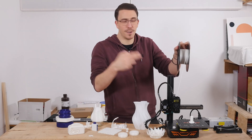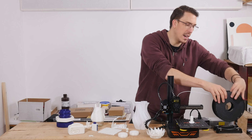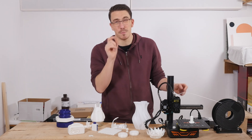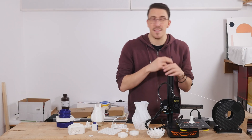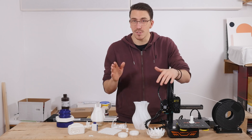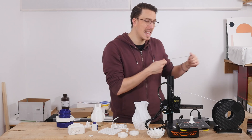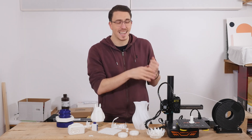The last caveat is where the filament comes in — it runs filament over plastic and that's going to wear away; it already started wearing for me. I moved the filament up above on a shelf and that's been perfectly fine. You can 3D print a mod for that — there are already files online — or I'm personally going to epoxy a small copper tube in there, and that'll sort it out.